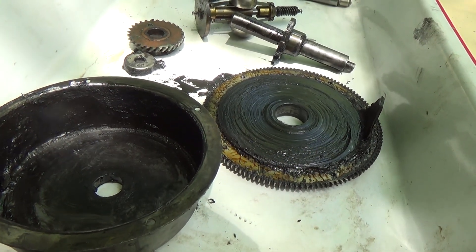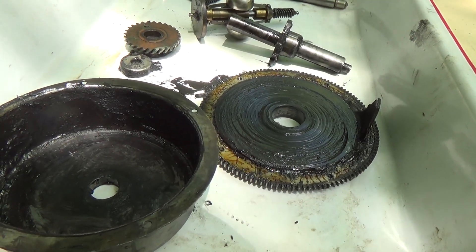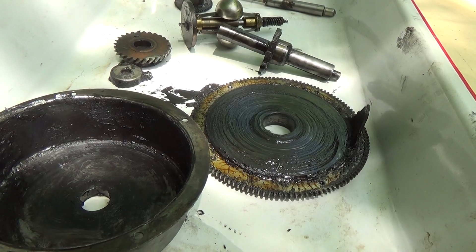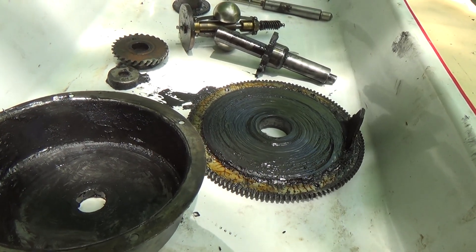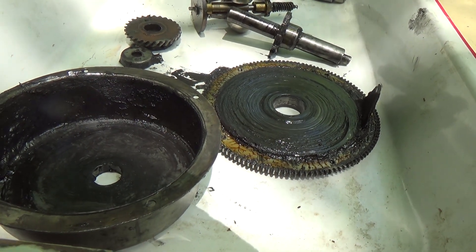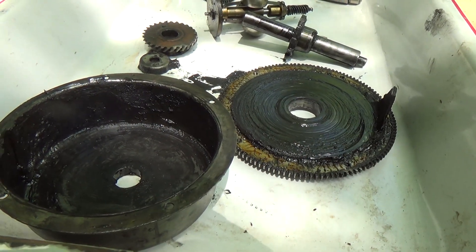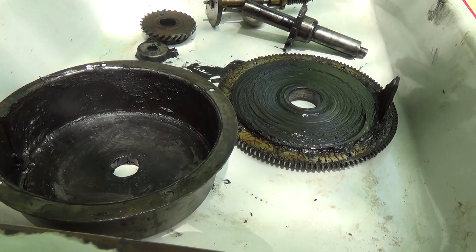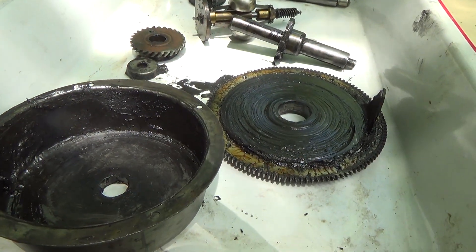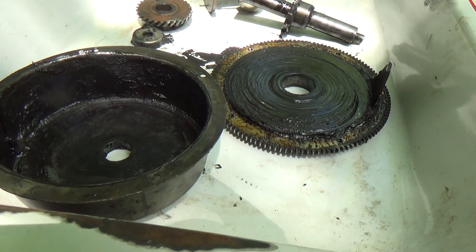For a brand new spring, I go with the same high-pressure lubricants that I use on my automobiles, which cost many, many times what this motor does. So if I trust them on that, I certainly trust them on this. They have anti-wear lube additives, anti-corrosion additives — all things that 1920s grease did not have. There are super lubes, all kinds of stuff. Magic space-age technology — take advantage of it. Some people still like to use the old Vaseline and graphite mix, and that's fine. But you do have better alternatives.